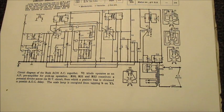Okay, it's now over to this circuit diagram. As can be seen, this radio is a 4-valver including the rectifier. It is designed for 200–250 volts AC at 50 Hz operation. As I pointed out in Part 1, it incorporates three bands: long wave, medium wave, and short wave. Though on the surface this entire circuit diagram appears straightforward, it is, like all superhet circuits, quite complex.